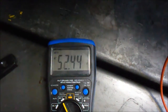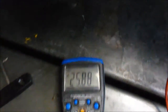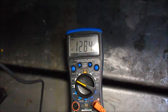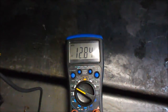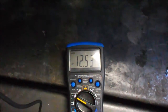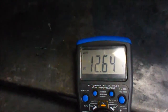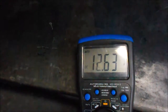That's 3,000 RPM right there, that's 4,000 RPM right there. Okay, it's all hooked up. Right now it's got 12.84 volts. We're going to start it up and see how it charges. Okay, 12.64 — see how much it takes to start it.